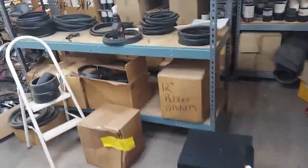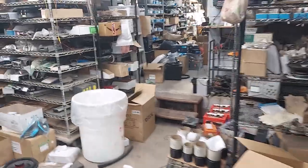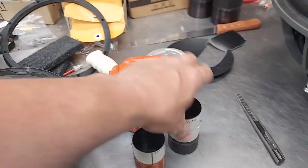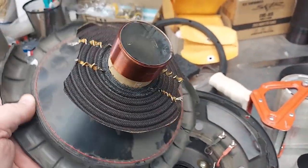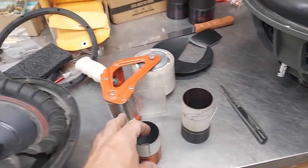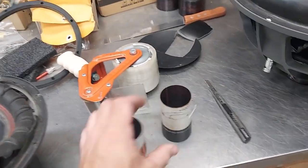These are the dual 4s and here's the dual 8 — the dual 8 is actually like a 6-ohm DCR, which is pretty standard in audio. The D4 fits as well, so I'll have to decide what amp I want to use with it. The original was a dual 2, so the gap is going to be a little on the large side. The difference in coils is that on the 2-ohm they use bigger wire. The higher the impedance, the smaller the wire — you also get more turns, more windings in the gap.